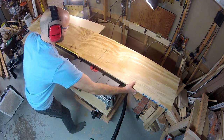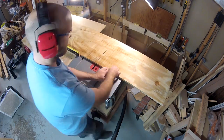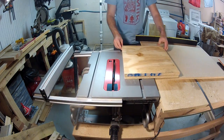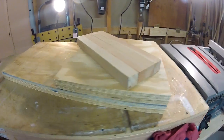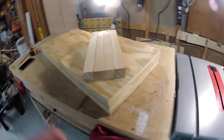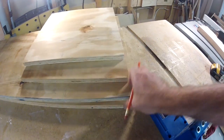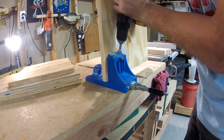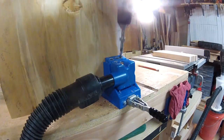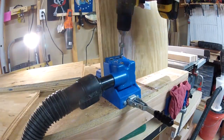Now I'm going to take the piece of plywood that I cut at Home Depot and cut it all to length. The first few cuts I'm making with a table saw but can easily be done with a circular saw. I needed a large sled for the first cuts, but this cut can easily be made with the fence. Once you've made all your cuts, you should have enough for the main structure as well as enough plywood left over for both the bottom and the lid. It's also a good idea to mark the inside bottom of each piece, because now I'm going to be making pocket holes to attach the corner pieces to the walls — only on the sides, not the bottom and top. Add two pocket holes on the top and bottom for structural support and then one in the middle to deter against warping or bending in the plywood over time.